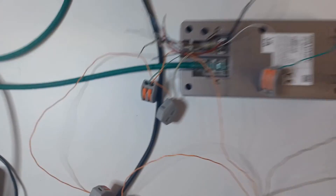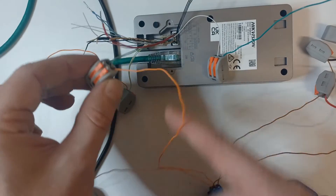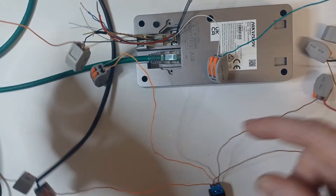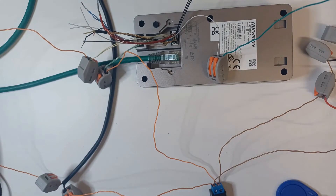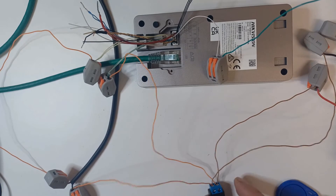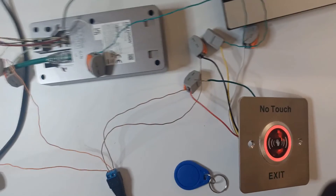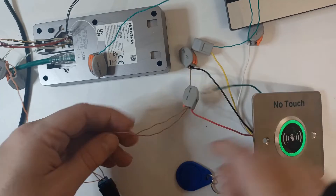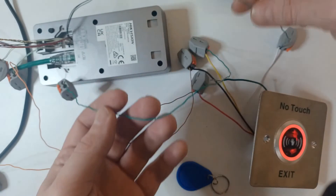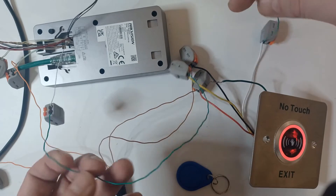For the cabling system - for the main station I'm using the orange cable. It goes from the green to the orange to the power supply, and then that goes to the mag lock, and then around to the yellow cable - one small loop. Our power supply is using four cables out, powering two devices. Here we have this connected to the no-touch exit button on the black and red cable - essentially a mini loop just for power. The exit button is also connected to the green cable, which is the data line telling the system when to open and close.